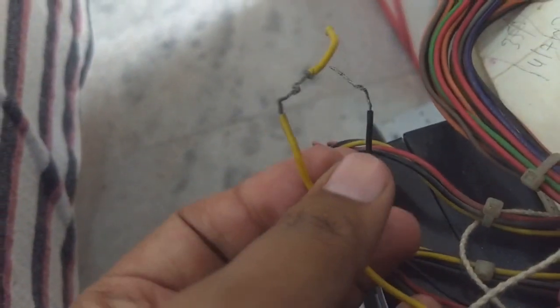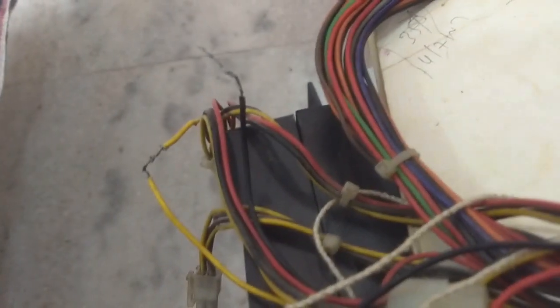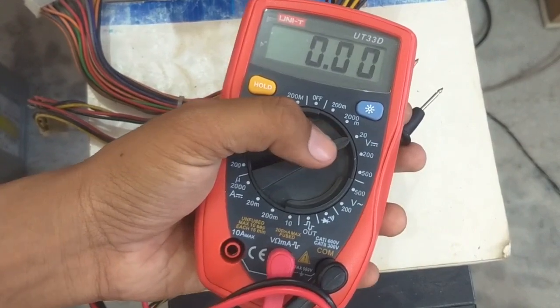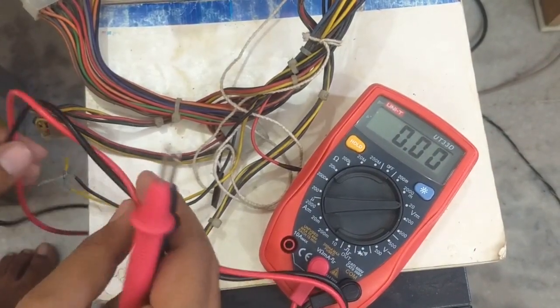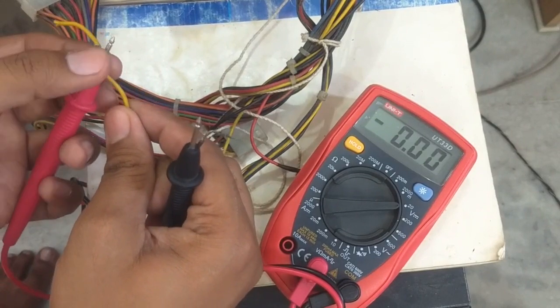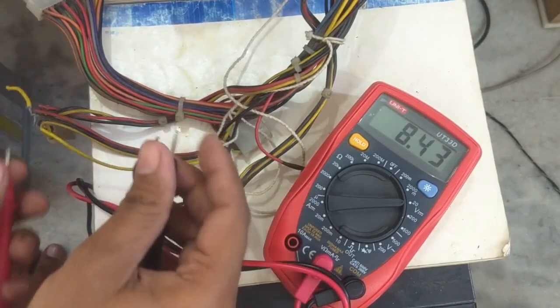I've turned on the power supply and as you can see the fan inside is spinning. Now let's connect the motor to our yellow and black rail. I've separated two wires — the yellow wire is our 12 volt positive and the black wire is our neutral or ground. I also have a multimeter set to measure voltage at the 20 volt range. Connecting the two wires to the multimeter terminals, as you can see we are getting 12 volts.